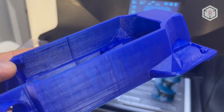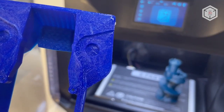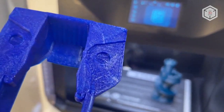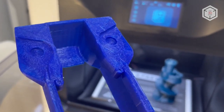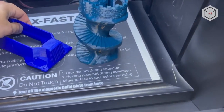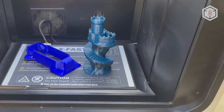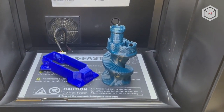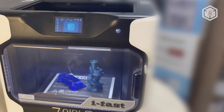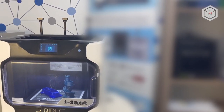The extruder swap, marketed by QIDI as being quick, in fact, can hardly be called fast. It requires reconnecting the cables and some disassembly procedures. In general, this is not the most convenient implementation of such a solution, but it works great with no additional settings changes in the slicer needed. And the print results are solid proof of that. We would classify the mechanical printhead switching system as a disadvantage, but this is a subjective opinion. Such a solution does make the extruder lighter, but at the same time, its reliability could be higher. It's rather uneasy to connect the ribbon cable when replacing the dual extruder with the high-temperature single nozzle one.